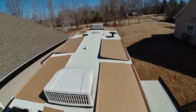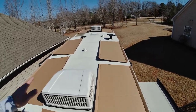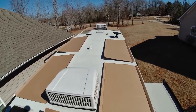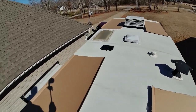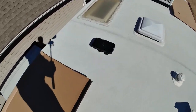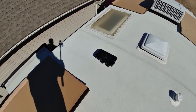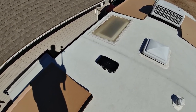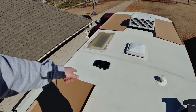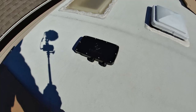And so what I've done is I've laid out my panels. I've made sure that all of my wires are going to reach where I need them to reach. So I need them to reach where this particular combiner box is. So I'm going to go into a closet in our bathroom, and that's going to be an easy spot for me to drill a hole in the roof. This is the worst part of this solar hookup, and I'm going to go in right through this box, make waterproof connections, and I'll be able to make all of my connections into the box.